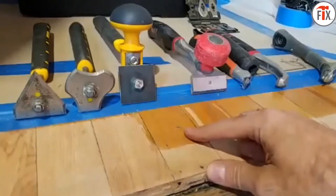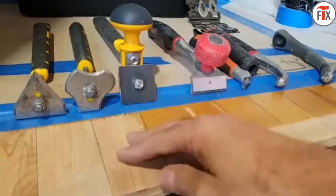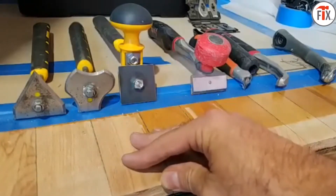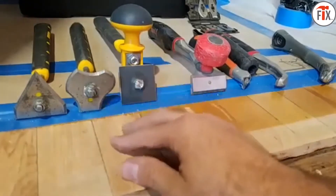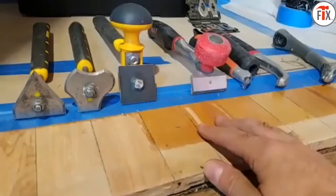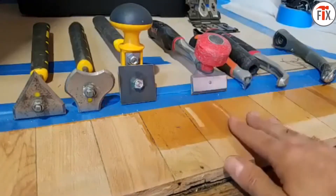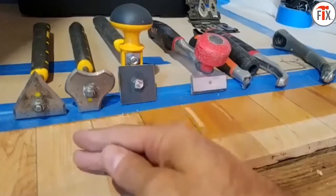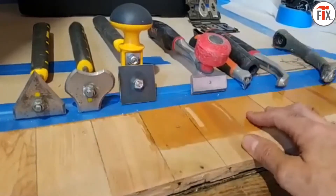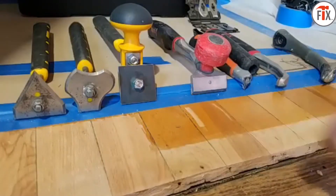There are basically two different types of scraping when stripping paint. You either heat it up with infrared heat or you dry scrape it. With the speed heater, the Cobra softens the paint kind of like bubble gum off your shoe — it comes off really easy. Dry scraping is a different story. I usually use carbide for dry scraping, and speed heater scrapers for softened paint.